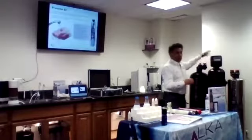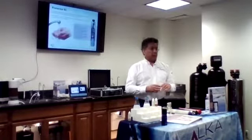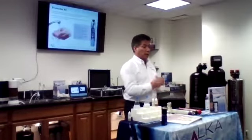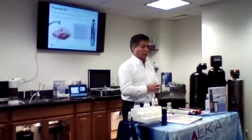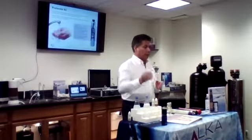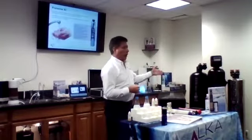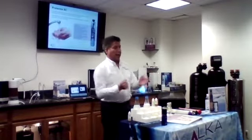The piping, the connections on a regular house are from 3/4 to 1 inch. On the bigger houses will be from 1 inch to 1.5 inches, which has more gallons per minute and requires a bigger system, which we have too.